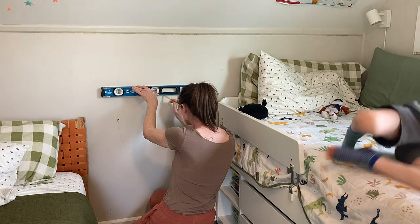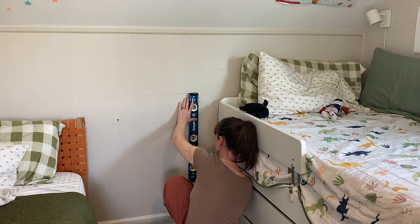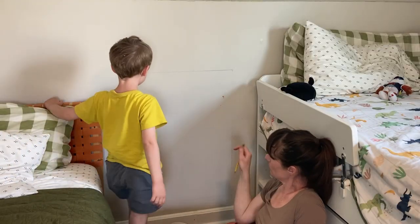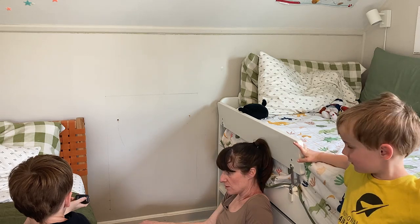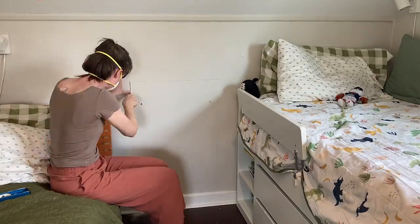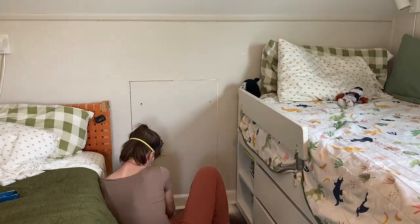This hidden door is a custom design, so my dimensions are based entirely on look and functionality. I used a level to make sure the opening was square, then cut the wall open with a drywall saw. The original opening before the trim and casing is 30 inches high by 22 inches wide.